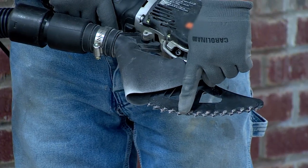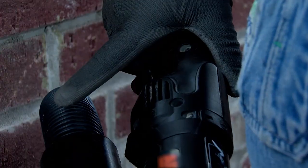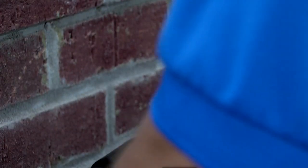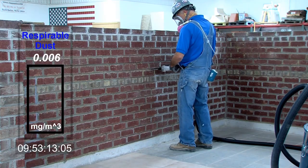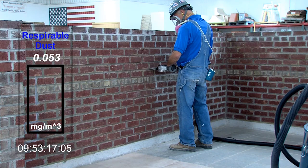When using a general purpose blade, the best cutting area is along this section here. Make sure you start the tool before you push it into your brick surface. To start the cut, hold the tool firmly in your hands and apply the middle of the blade's cutting edge to the mortar.